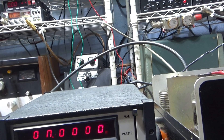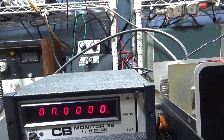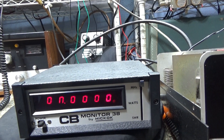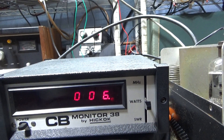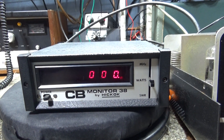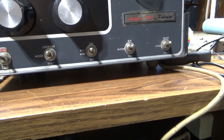So anyway, on the Hickok 38: it's a zero-to-100-watt watt meter — the manual said it takes one or two watts to get it going — and it reads automatic SWR and has an automatic frequency counter. I personally hate it for watts, especially if you're trying to peak or tune at six watts on a 100-watt scale. But I love it for the SWR meter and the frequency counter. This SWR meter is placed in-line between the radio up there and the Palomar Skipper here, and the Palomar Skipper is actually on and operating.